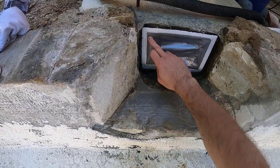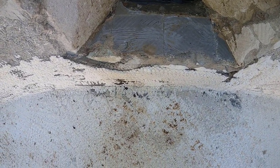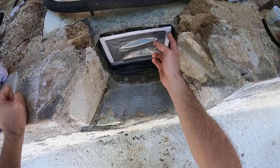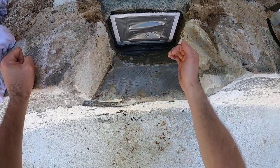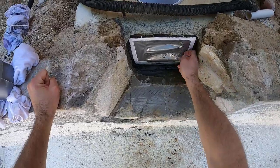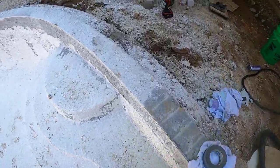Okay, so I think we've got this face ready — you can see we just taped off the opening here. The purpose is just to keep the cement product from getting inside the skimmer throat. We'll actually remove it really immediately after we get done applying the cement, before it fully sets up and cures. What you don't want is your cement to overlap the tape. If the tape is out on the edge and the cement overlaps it and you go to remove it after the cement has already set up, it'll tear off and that tape gets stuck under the cement, which compromises the seal you're trying to achieve with the hydraulic cement.